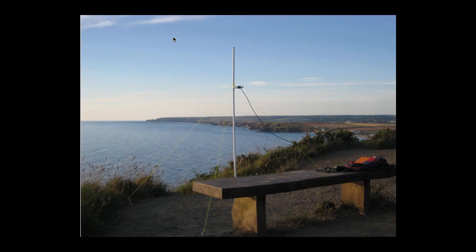I'll show you the picture of the antenna when it's fully assembled from the website, then we'll go through a few pictures. So the first picture is the antenna itself. It's for 4m/2m but yesterday I tried it on 70 centimeters and it worked great. It's made of PVC with vertical dipoles, and you can apparently listen to SSB on it if you put it horizontal instead of vertical.